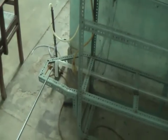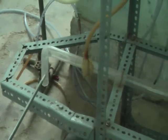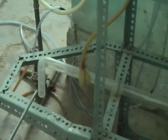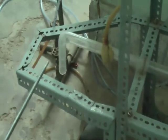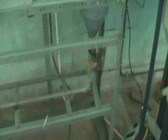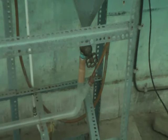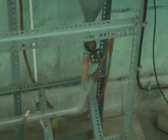The flow rate of the liquid can be measured by measuring the volume of liquid collected at the outlet across a given time interval. By varying the liquid and the gas flow rates, we will get different flow regimes. These flow regimes can be observed through the transparent pipe.